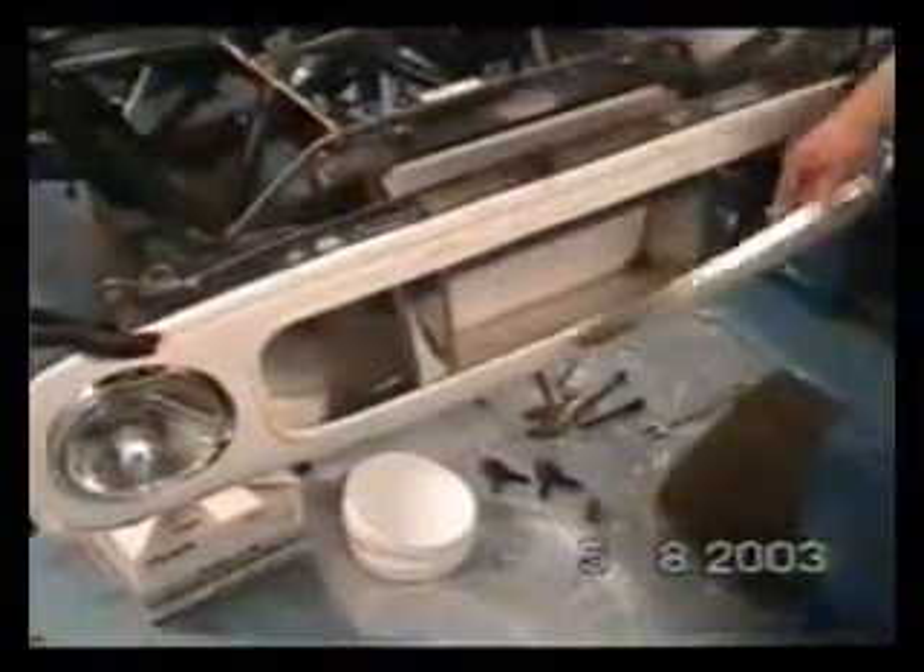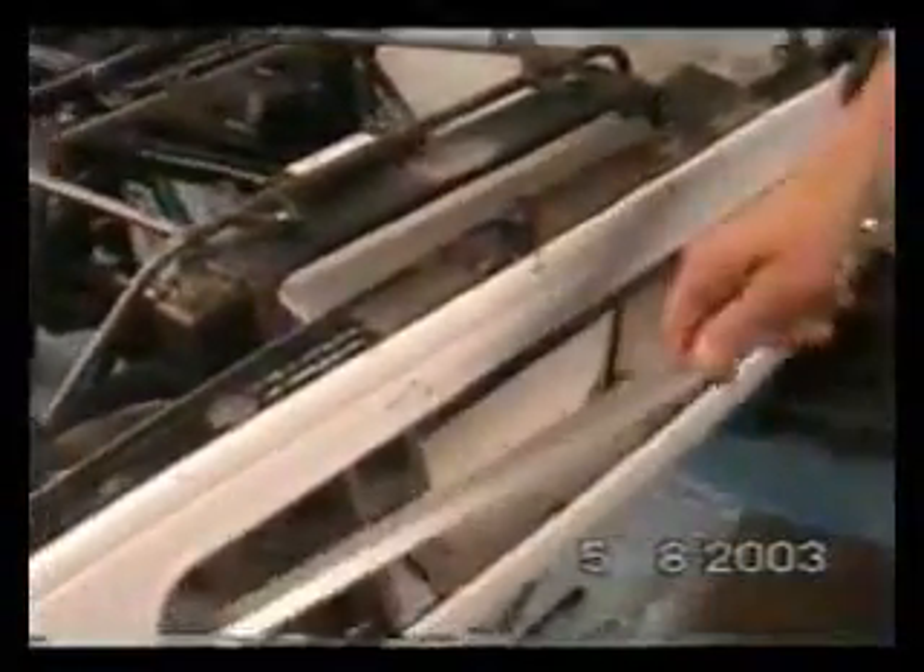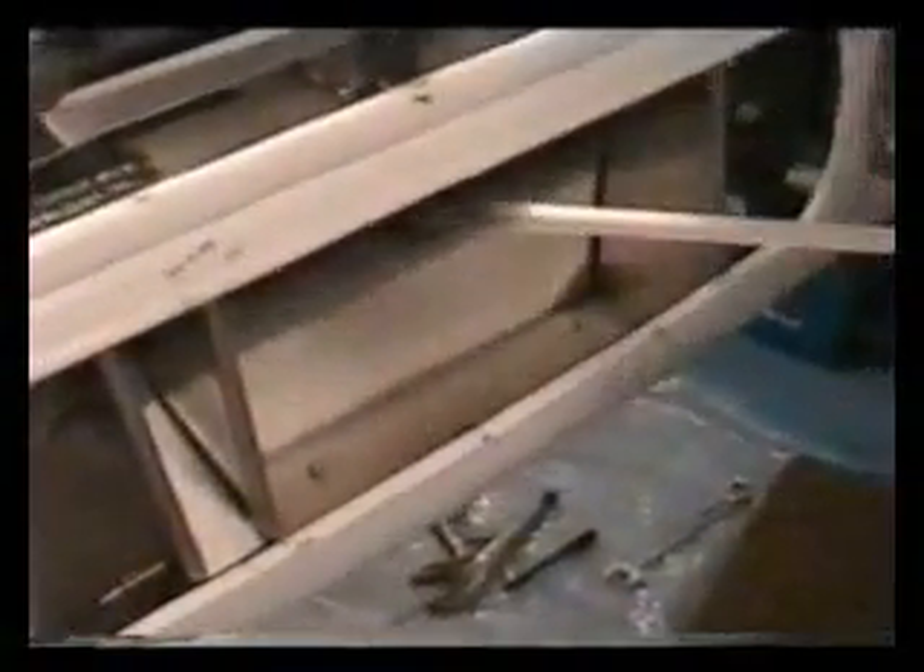Recently I've been working on the air inlet for the front grille. I've mounted the front grille to the body. That area there is for the air filter, and that's just another air inlet for cool air. This is the ducting for the radiator — radiuses on each corner. This air inlet here is half the size of the actual radiator, so the air goes through and then expands and slows down. There's also a little diffuser vane there to direct the air upwards.